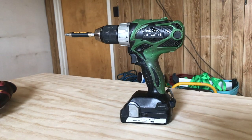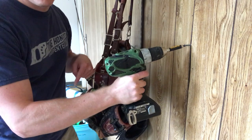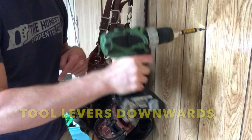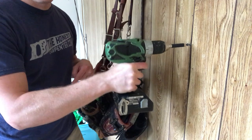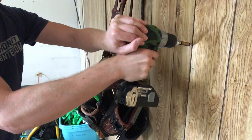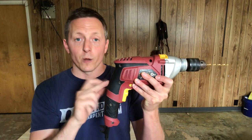But the mid-handle placement takes away from your overall power because the hand is no longer in line with the drive path — it's below it now. So when you push really hard, it'll cause the tool to lever downwards. You can feel the strain from doing this in the webbing between your thumb and forefinger. If you want to get good direct force with the mid-handle, you almost always have to put your free hand on the rounded back, bracing and pushing the tool forward. Force has to be directly applied, which is really what the pistol grip is for.